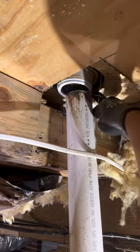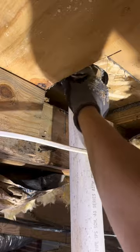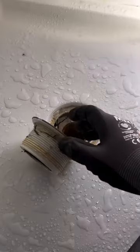No-caulk shower drains are great if used right, but in this case I'm going to remove it and swap it out with an Oatey solvent weld shower drain, because I know it's not going to leak, it's not going to have any issues, and I won't get any callbacks — because there's nothing worse than that, am I right?